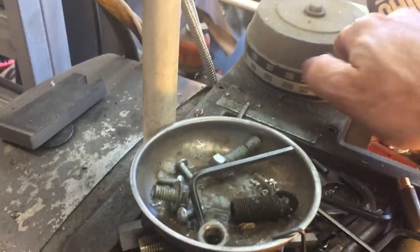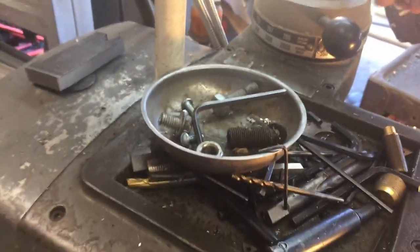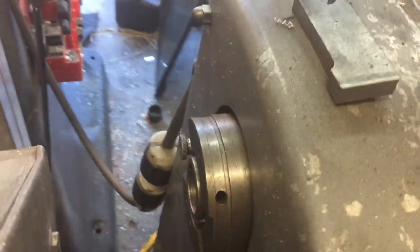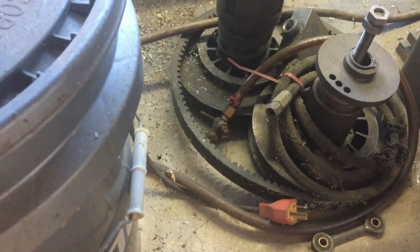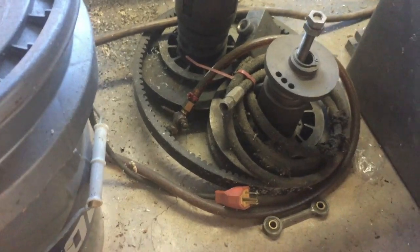All that worked with this dude over here, which was how you adjusted the speed. It's got a cam in it, and it pushes on this master cylinder, which is like a brake master cylinder in your car. I've always told myself I'm going to cut this thing off one day. A hose would come off of this and go down underneath where there was a cylinder, and the cylinder would activate this variable geometry pulley mechanism, which one of these days I'm going to post on eBay. Now that I'm posting this video of removing that, no one's going to want to go that way. They're going to want to go what I did.